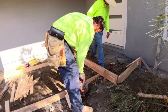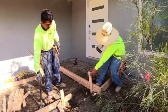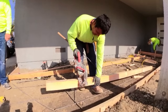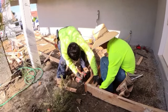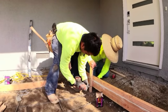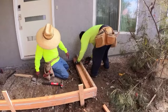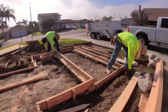We just had to tear it down and redo it because they had it all set up for one pour, and you can't pour it in one pour because you can't strip and face the steps. You have to leave two of the steps open. We use four-by-fours because they wanted a three and a half inch lip under the cantilever. The way it was set up before was with two-by-fours underneath, and there's no way you could strip it and face it. The whole thing was not set up right.